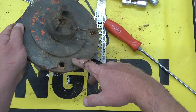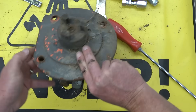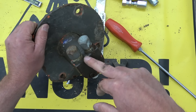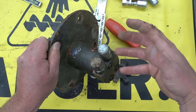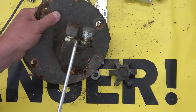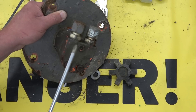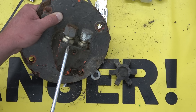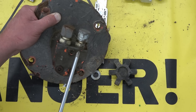It'll have a mounting plate with an SAE designation for mounting the pump, but this appears to be some sort of proprietary system — some sort of piece of mining gear. The fittings will also be standardized. The good thing about standards is none of them match together, so somebody comes along and makes one standard to rule them all that doesn't match any of the rest. By eye, these fittings will be dash-eight JIC male. Dash-eight just means half an inch — dash sizes are sixteenths of an inch. We'll also have some BSP, British Standard Parallel Pipe, into the actual motor, with a bonded seal ring to keep in the magic schmoo.